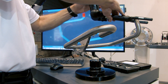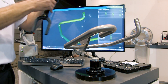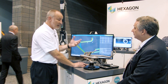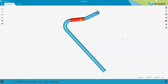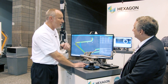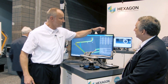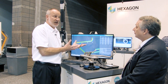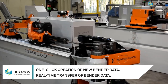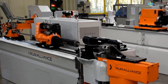It'll have us measure the second end. And at the end, it gives us all of our nominal and measured data. A lot of benders go by LRA data, which is length, rotation, angle — we have that type of data. We also have all of your XYZ intersection points. So at the end, you have your nominal, your measured, your deviations. We can also talk directly to a bender — come down to a bender link and send this information right back to the bender. It does the corrections on the bender automatically.